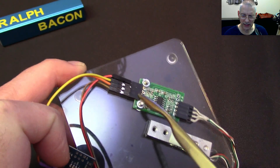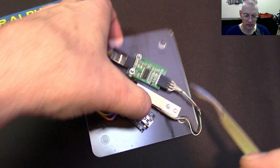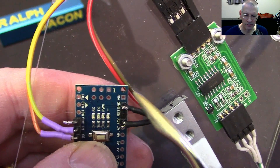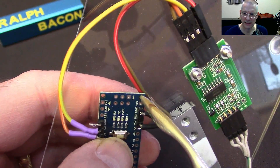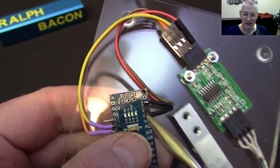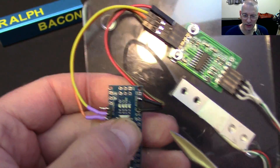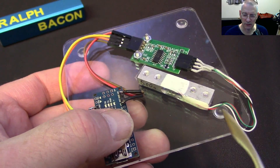This is the Arduino Nano, and this is the thing that's causing me grief when it comes to mounting. I don't like the way I've mounted these pins. These little tiny mounting holes — I assumed they were M2 bolts. Nope, they're M1.6. Do you think I have any stock of M1.6? No, of course not — who has anything that tiny? I thought about reaming them out but frankly I just want to get this done, so I've put in a quick order on eBay for some M1.6 bolts to mount the Nano. I also need to sort out a reset switch somewhere.